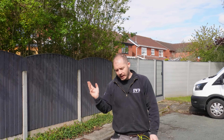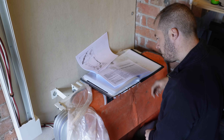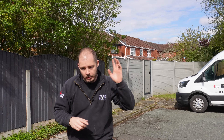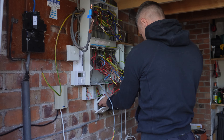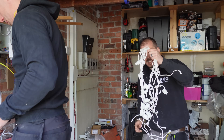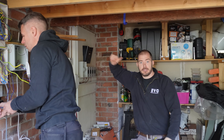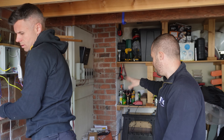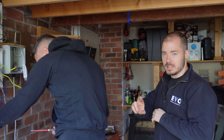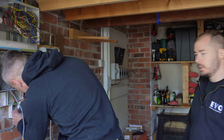We're back on day two. All of the hooks got put in yesterday, battery got mounted, inverter got mounted, isolators got done. We're now on with the board change. We've got a double stacked board — quite a lot to change here — and it had CT monitoring on every load, so those have to go back in. We'll get our feed across to the battery and inverter. Hopefully the lads on the roof will be done this afternoon; fingers crossed we can get it commissioned today.